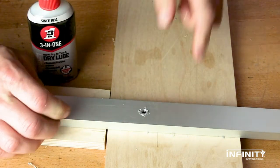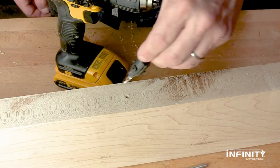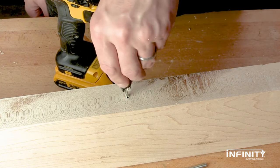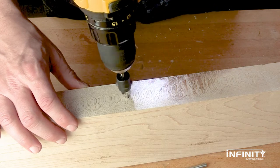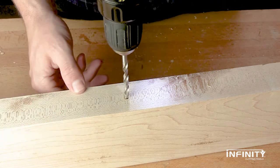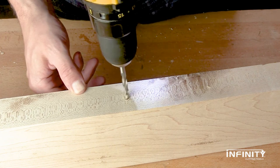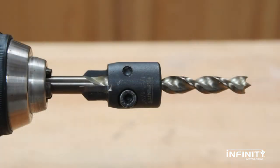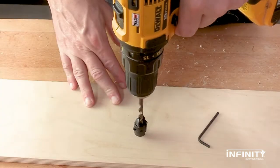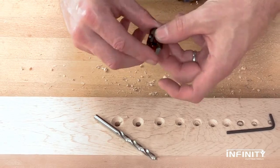Just make sure you use a lower speed and some sort of cutting lubricant. If you've ever needed to increase the diameter of an existing hole, you know it's not easy keeping the larger bits centered and preventing wandering — no problem for the adjustable countersink. Just insert a bit sized from the existing hole into the countersink and use it as a guide to make a very slight chamfer centered around the rim. Register the larger bit in the indentation left by the chamfer and voilà. In a pinch you can even use it as an impromptu depth stop — just flip it around and use it as you normally would, aligning the flat portion at the maximum depth.